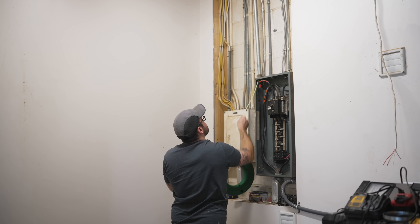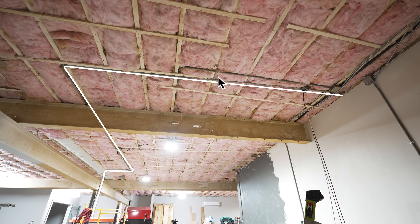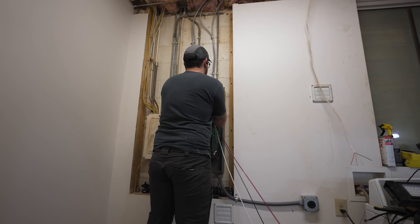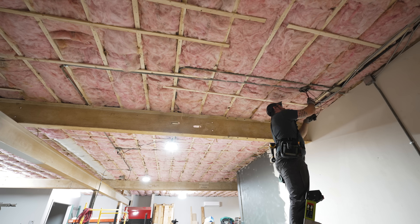For the outlet behind me for my planer I needed to use eight gauge wire, and I couldn't find MC cable in that size locally, so I had to run EMT conduit all the way back to the panel. After doing some detective work with my fish wire, I was actually lucky enough to find an existing run of conduit coming out towards the center of the shop. From there I just pieced everything together using plenty of junction boxes, making sure I had plenty of pull points, and once I had all the conduit run I could pull the wire, which was really simple with all of those junction boxes.